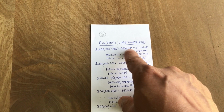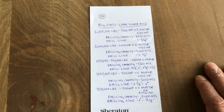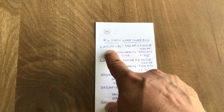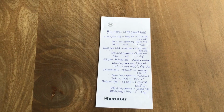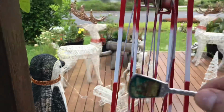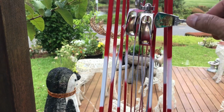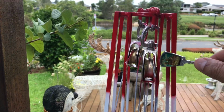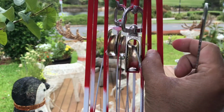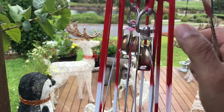But horsepower is a self-determined, imaginary kind of benchmark, but definitely you need to build your rig to this capacity to lift as much as you can. That is the determination of the capacity of a rig. So the horsepower of the rig is the strength of your mast capacity, not the number of engines you have. The more horsepower, in the sense, the more capacity you have in the construction of this mast, to make it stronger with the thicker square pipe you use to build your rig, the wider you go, the more strength.